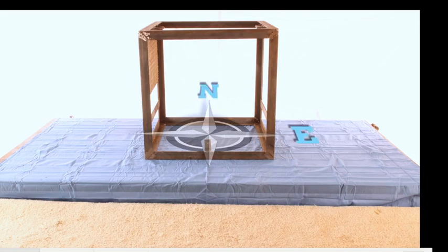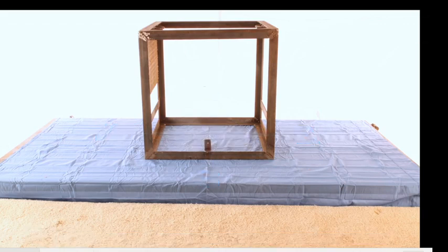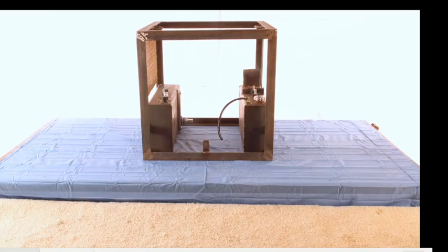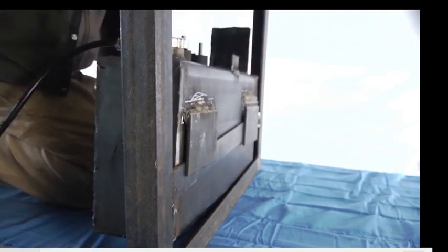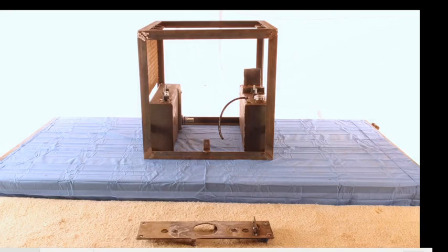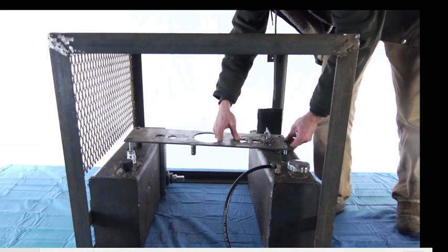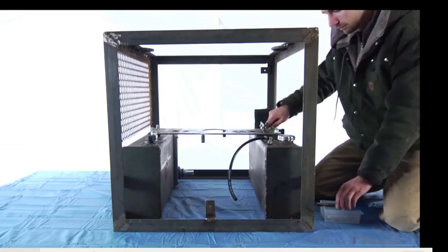Actually the biggest difference right now in what we're doing is, this has all the components on it. Now we're saying, let's make a cube with only the fuel tank, hydraulic system, and the cooler fan. Let's keep the engine and pump separate, because those are the things that go bad on you. All the stuff you see here, plus the fan and filter and control panel, that's the engine mount, that's how we did it in that case. Do that and use that for all the power cubes.